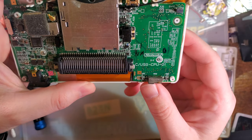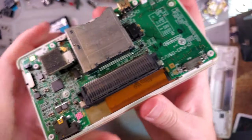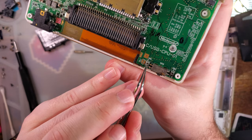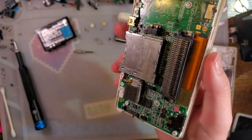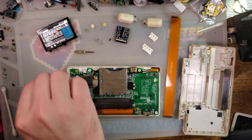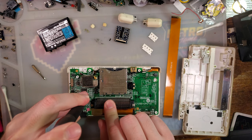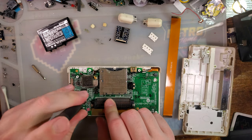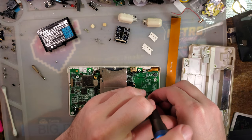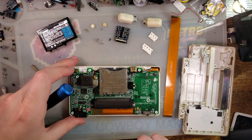But other than that, there you go, and there is that potentiometer that is right next to the pad. If you short your tweezers on any one of these two pads to the metal of this potentiometer, it will put voltage in a place where the system is not expecting it, and it will trigger a safety shutdown. Granted, if you're shorting that out, you're probably flashing the BIOS, so there's nothing safe about shutting down at that point. But luckily, it's pretty hard to actually permanently break your device,